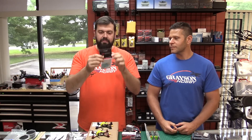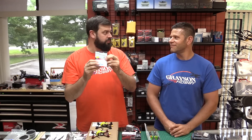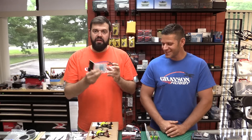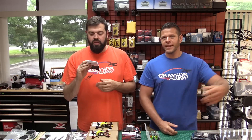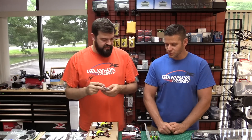While we're talking about receivers, we got from KS Servo the RS610 receiver. It's a DSM2/DSMX receiver that also binds with Walkera. It's primarily for planes, though it does have PPM and S-Bus so you could use it on a quad if needed. It's a great little park flyer receiver at $10. It works with both DSM2 and DSMX, so older radios are fine. We'll do a video on this one because the directions don't match what you actually have to do.